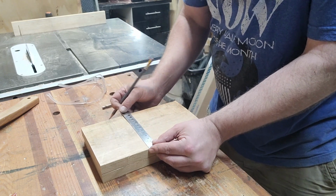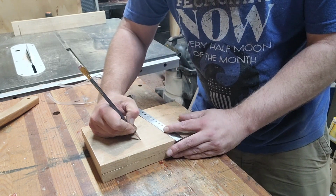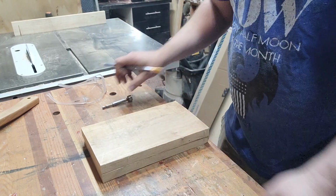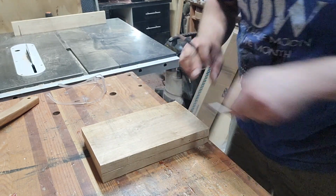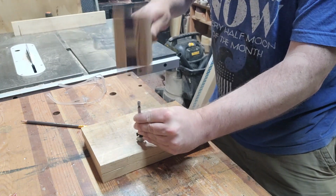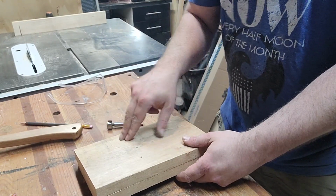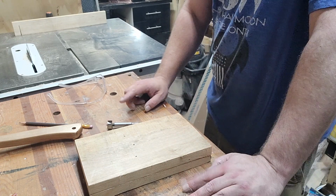I'm actually going to move the front two, or the side two, up just slightly. We'll cut there, there, and there, pop some holes, and then we'll draw our fingers at 3/4 inch, I think, Forstner bit, 7/8 inch Forstner bit, we'll go all the way through both of them. We'll have our holes that are going to start, and then we'll draw our fingers from there. We should draw it on there first, probably.